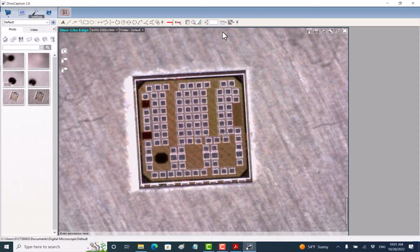Now you are not able to see what is underneath because all the transistors are at the bottom layer, gate oxide, and on top of that, you have maybe 9 layers of metal. And between each metal, you have the insulation. The metal is just the routing, just like the breadboard wire you did in the lab, right? But now you put everything on the chip.